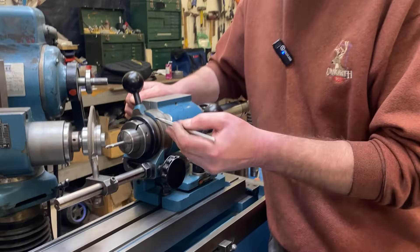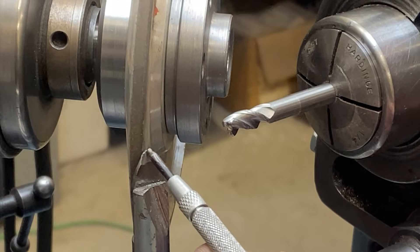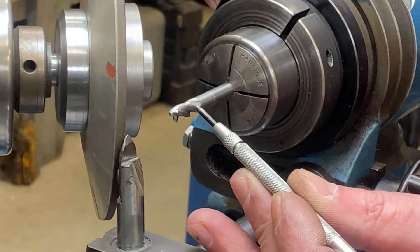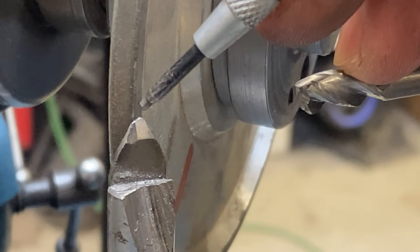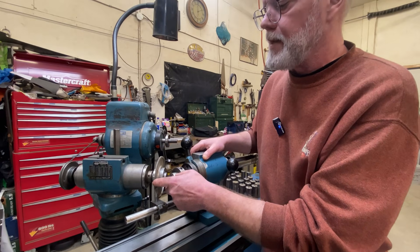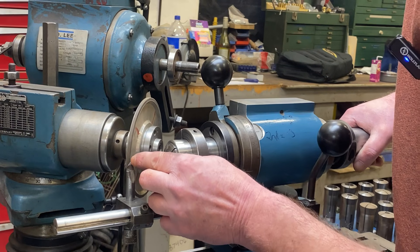This next step is actually super important. We're going to want to position our pointer finger in relation to the part of our wheel that's going to do the cutting. We definitely want the point of our finger to this side of the cutting edge, because we want to be able to control the rotation of our end mill until it's completely off the wheel. Here's the point on my stylus that's going to contact the face of the tooth, and over here is the part of the wheel that's going to do the cutting. There is a bit of give and take to it because your pointer is going to bottom out at the back of your flute slightly before your grinding wheel is grinding at the back of your flute. So we are going to lose a wee bit of cutting length — essentially about the same amount that you've offset this point from the part of the wheel that's doing the cutting.